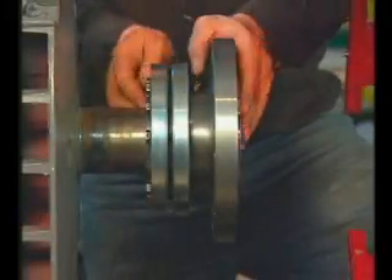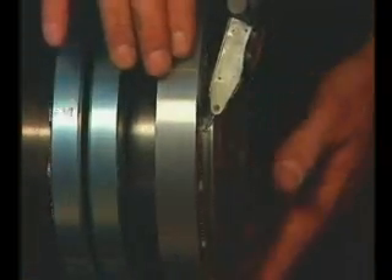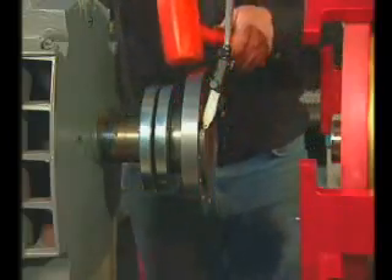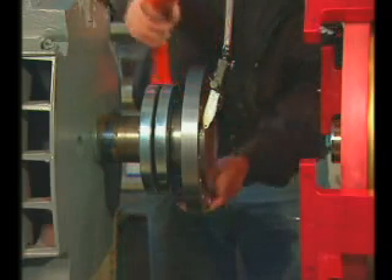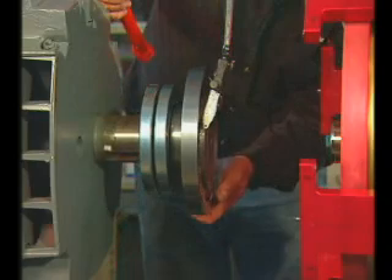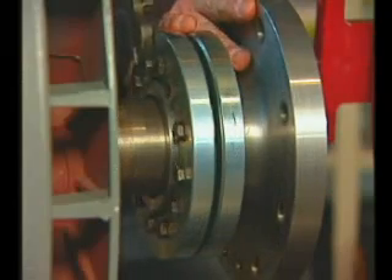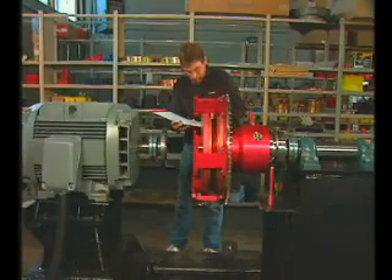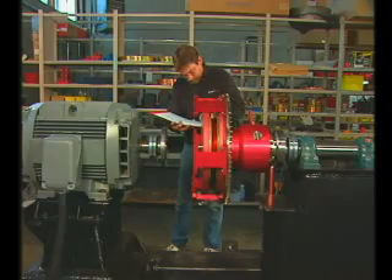After tightening the motor side B-lock clamps so the assembly no longer rotates freely, place the dial indicator on the hub and measure and adjust the radial and face runout, ensuring that total indicated runout of each face is less than one thousandth of an inch. This step is crucial. If total indicated runout exceeds specifications, locate the high point of runout at 12 o'clock and apply a blow with a soft-sided mallet on the edge of the hub to correct the runout. Final torque the shrink disc bolts in a circular pattern. Record the shrink disc screw torque and total indicated runout on the installation checklist. Verify the runout measurements to ensure that the hub stayed in position.